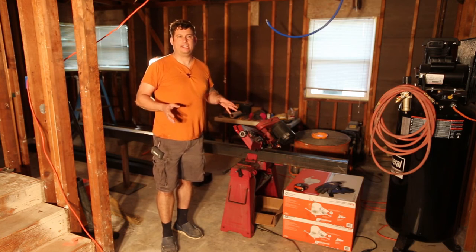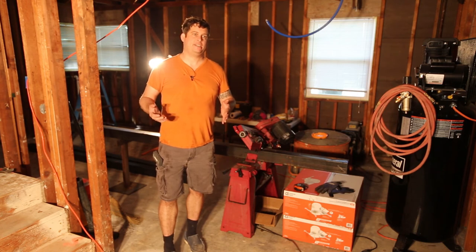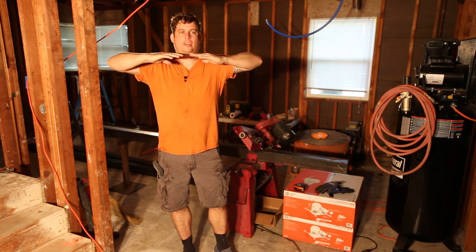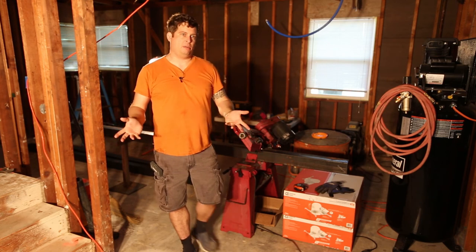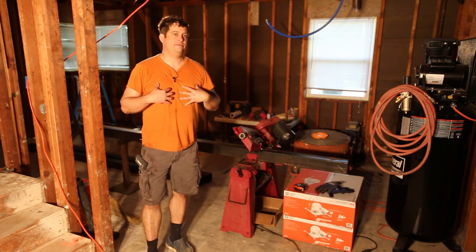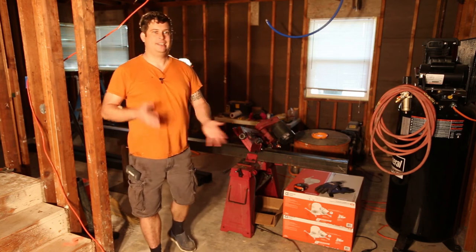While I'm cutting, I'm actually cutting the pieces that run from the front to the back. I want to talk about the design characteristics when you design an aquarium stand. One of the concepts is called modulus of elasticity — it essentially is how much the structure will flex. So if my hands are the beam and I put them together forming a beam where they touch in the middle, I could put a load on it and how much that would cause my hands to flex would be the modulus of elasticity. I'm not an engineer. I do play one on YouTube, but I'm still not an engineer. I have taken some basic classes taught by a licensed professional engineer through my local makerspace — that still doesn't make me an engineer.